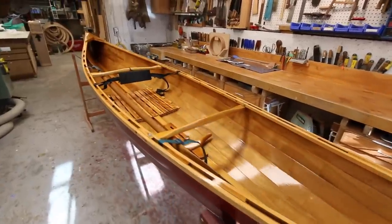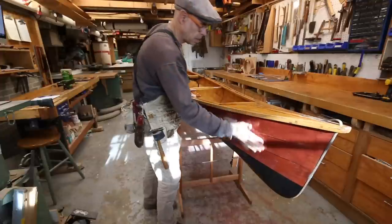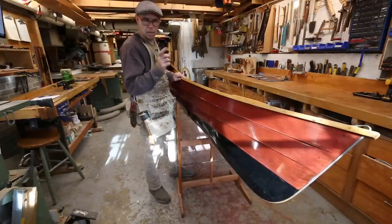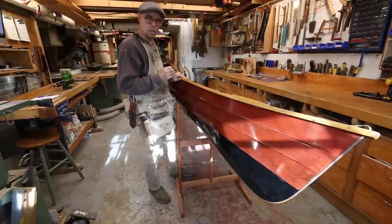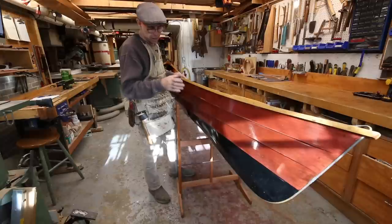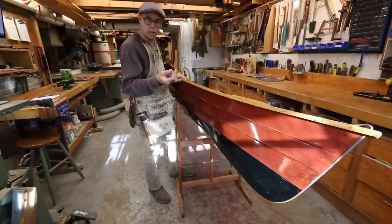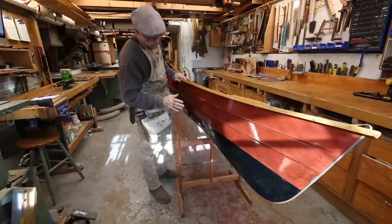Let's take a closer look at this boat and talk about what I did well and what I didn't do so well. Starting with the finishing: this is a varnished hull, however I didn't want to accentuate the grain of the plywood because I don't find marine plywood to have a particularly pleasing grain, but I did want color. So I used what's called a glaze — I varnished the hull a couple of coats and then started putting universal pigments into my varnish, putting on multiple layers of that tinted, translucent varnish.